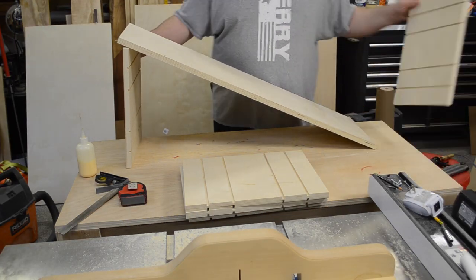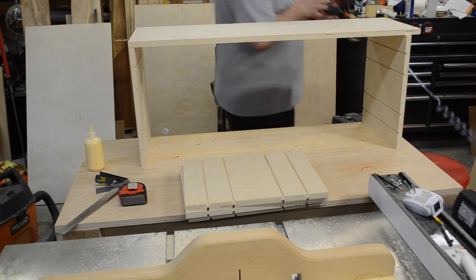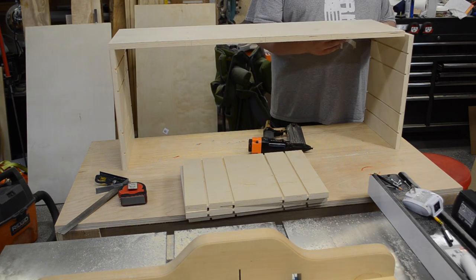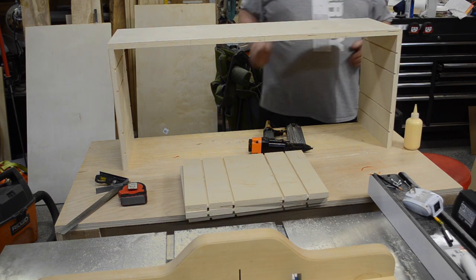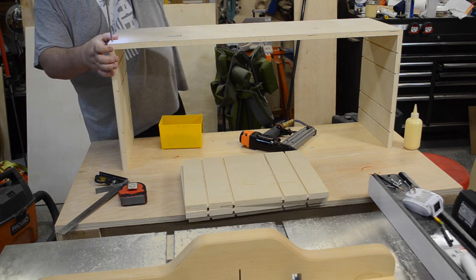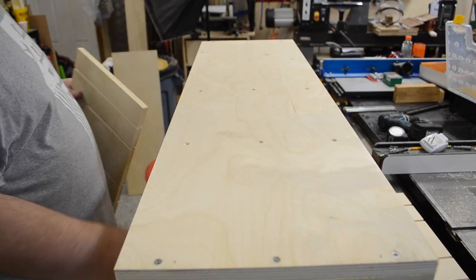Next was assembly. I started with essentially the top or bottom — at this point it doesn't necessarily have a top or bottom — stood it up on its ends, added a little bit of glue for extra insurance, and then using a brad nailer made sure everything was nice and flush and square, then added a couple brads to keep everything from sliding around. I pretty much repeated the process on the other end. It's not very stable with just the brad nails, but that's not for strength — it's just to keep things aligned so I can move on to adding screws. I added three screws in each joint, which may or may not be overkill considering this is going under an assembly table and won't have a lot of force on it, but it's only a few extra screws, so why not?